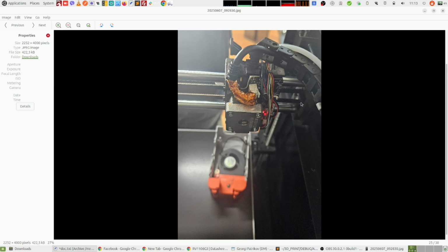So the issue there is probably not with the sensor, but with the plastic housing around it. And with time, it probably gets deformed somehow, and it causes the radiator, the heatsink that the nozzle comes in, to touch something and basically give weird and false readings for the pressure sensor.